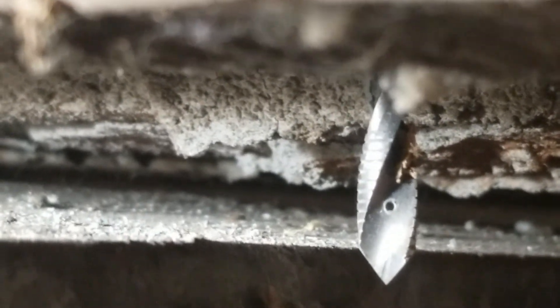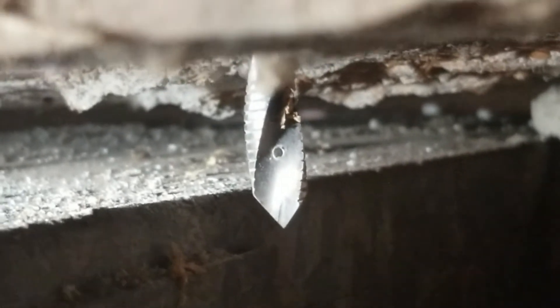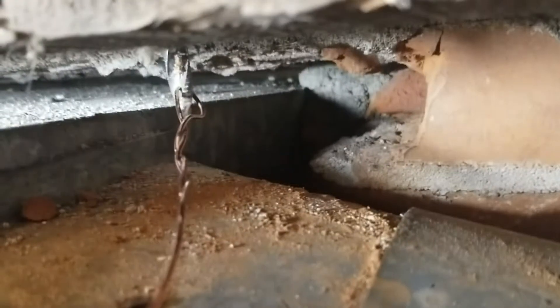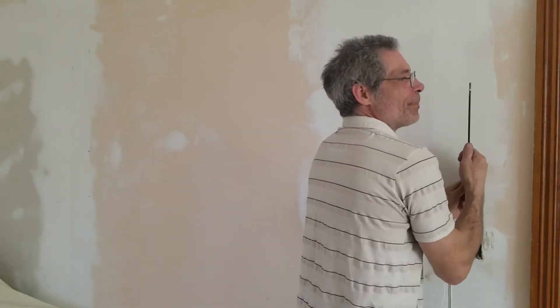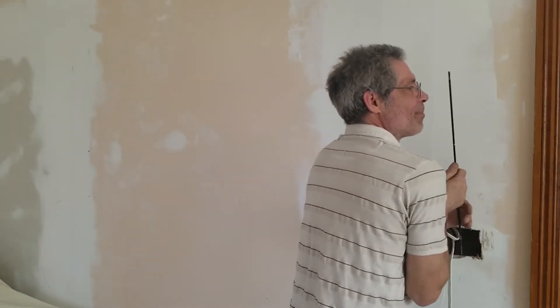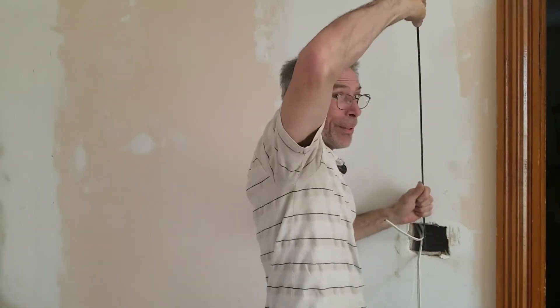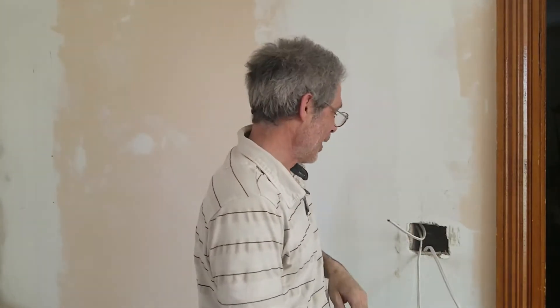Coming out of the floor — I see the hole. I'm going to try to thread the ground wire with the cable that I'm going to pull up through that hole. I got it through and threaded — you can see it — and it's connected to the wire. Now I tape it all up to give it a nice taper so it doesn't snag on anything. I'm getting a little twisting motion to get it back through the hole. There's my wire.